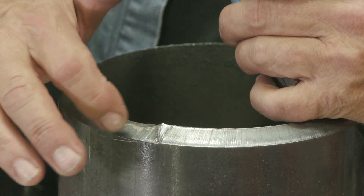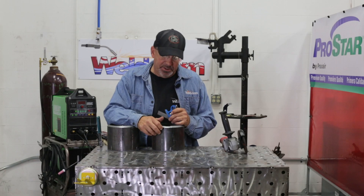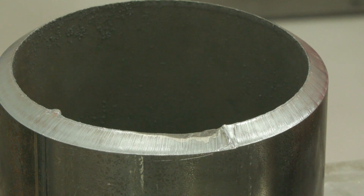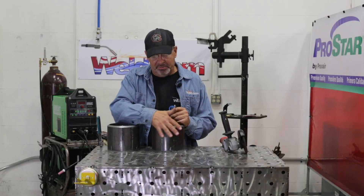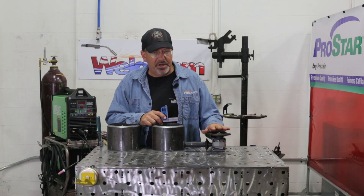I want to come in and clean them first because I want to TIG weld over this, build them up a little bit, bring it back to true dimension. This has got a right nasty burr on the inside and it's got a collapsed bevel face, sharp point, and a start and stop. Carbon steel — I'll be running some S2 or S6 wire, just going to TIG over this, clean it up, build it up, then come back and dress them off with a quarter-inch disc.